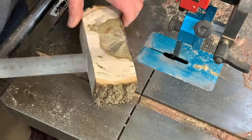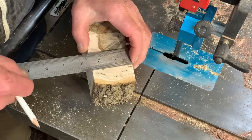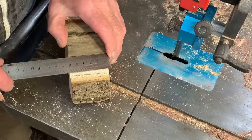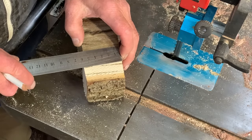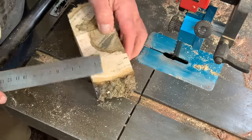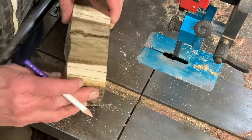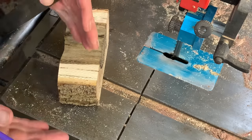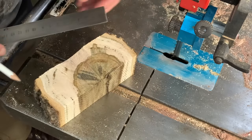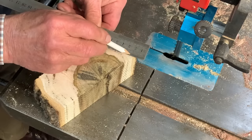So this block is 60 millimeters in that direction, which is just under 2.5 inches, and I'm going to work in millimeters, much easier. It's 58 mil that way. Now I'd really like to have this color in the bottom of the bowl. If I turn a bowl there, then it's going to be half black, half white, which is not really what I'm after. So I'm going to draw a line across here